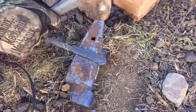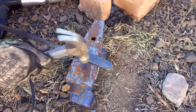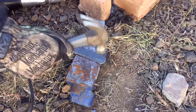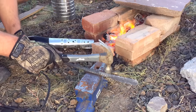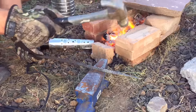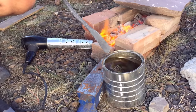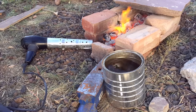Some people who are real blacksmithing purists will say you shouldn't be using those tools, you should use your hammer and keep practicing. You know what? I don't care. There are plenty of professional knife makers, blacksmiths, and bladesmiths that are more than happy to use power tools, grinders, files, hacksaws — whatever they have available to make life easier. Now I'll heat up the handle area of the knife a little bit and put just a little bit of a recurve on that. Then once that's done, this would be the part where I would probably quench the blade, but once you've quenched it'll be very hard and it's a lot easier to work on softer metal, especially if you're going to be filing by hand. So I'll save the quench for later.